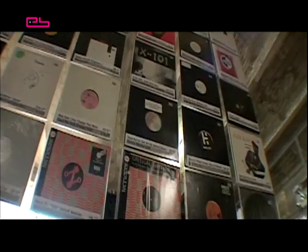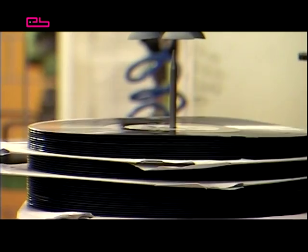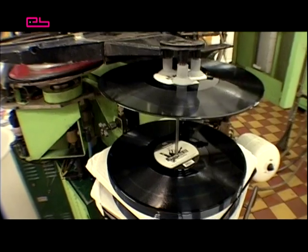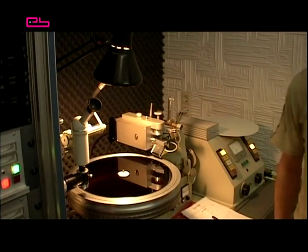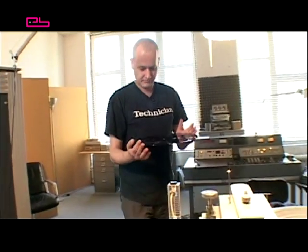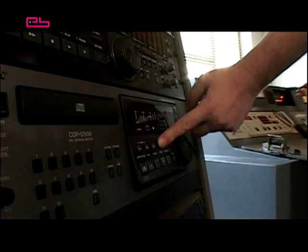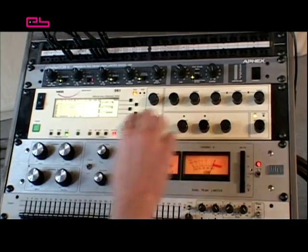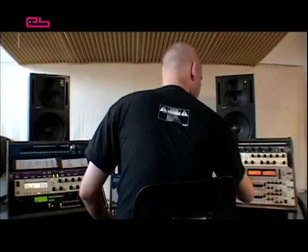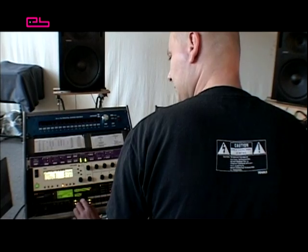From the finished cut and mastered foil in the mastering and cutting studio right up to the finalised record. In Germany, foils are cut by cutting studios such as RAND in Leipzig or dub plates and mastering in Berlin. Correct mastering in advance is very important as the tracks are optimised to the maximal level and optimal frequency spectrum that can be reproduced on vinyl. No wonder that some specialists have achieved cult status because of their mastering and cutting talents.